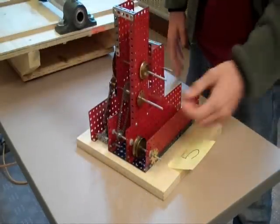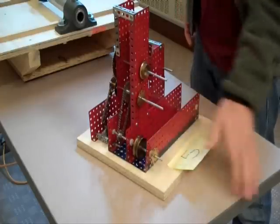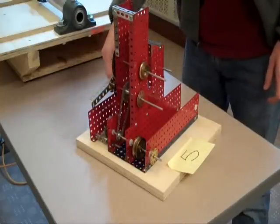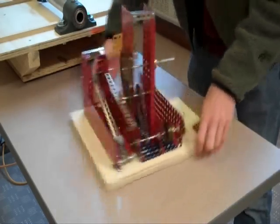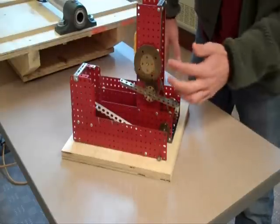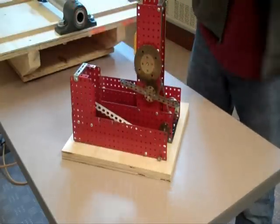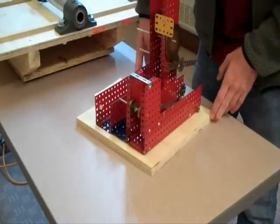This is team five. It takes the pulley off the shaft into this pulley right here. This shaft has nylon bearings on it. From this shaft we have a sprocket-and-chain setup which goes up to our main shaft, which controls a device that hits a ball up an incline. The ball, when it returns, is stopped by the spring — the shock is absorbed there. We have a clutch up here because we couldn't get these gears to mesh perfectly, so this is all friction, which comes up around to this gear that doesn't have teeth all the way around. This little piece acts as a brake as it rubs against the top part of the gear. It worked better on a low-torque test motor as opposed to the super high-torque one.